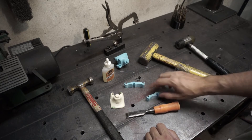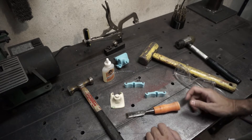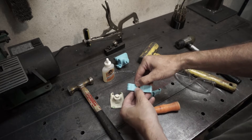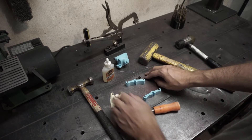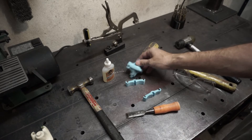For the second test, I set the parts down, put the glue on them, and put one of my 1-2-3 blocks on top — not real heavy, just set it on there. As you can see there's no gap on this one, and there's probably a 20 to 30 thousandths gap on the other. So we're going to bang all this stuff up — not this one, because I'm going to send that back to Keith — and see how strong this stuff is.